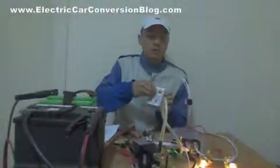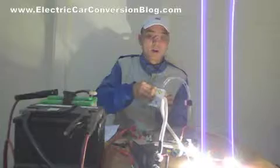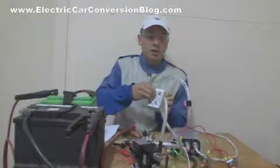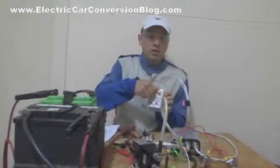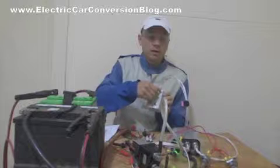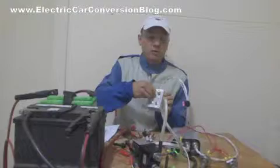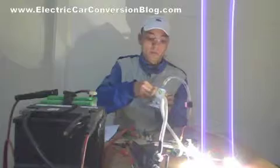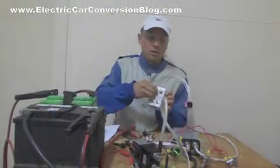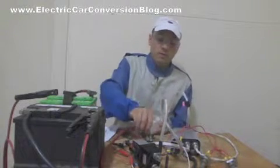I'm going to turn it back and they'll dim. Wind it up — it gets brighter. Wind it back — dimmer. Wind it up — it's getting brighter. Apply brake. Wind the throttle back. Turn the brake off. Wind the throttle up — the lights brighten up. Wind it back. Turn it off. And you probably heard the contactor release itself.